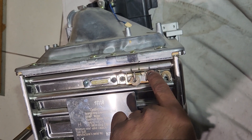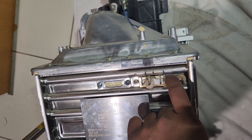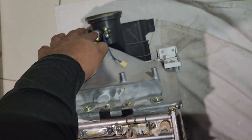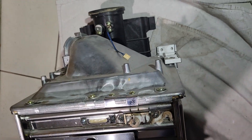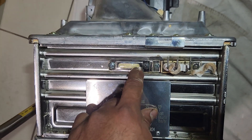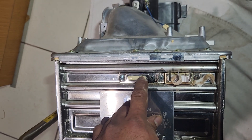I pushed these down a little bit to get it going until I got the new one. I also checked combustion — it was high CO. And you see that discoloration right there? That's a sign of bad combustion.